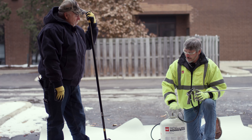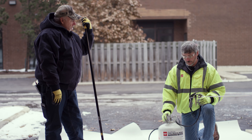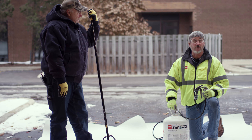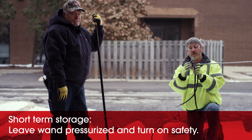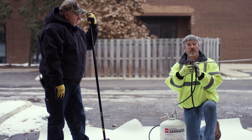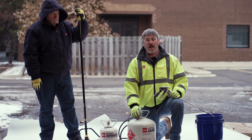So we're done with our adhesive. We got our membrane laid out, we got everything glued down. We've got about half this canister left. In order to store this, we're not going to turn this off — we're going to leave this open since we're going to use it in the very near future. The only thing we're going to do is lock this trigger down with the safety right here so it cannot be pulled. That's the only thing you do to store this.